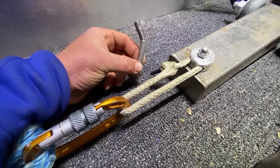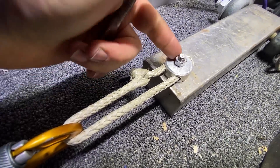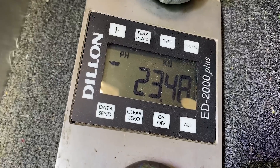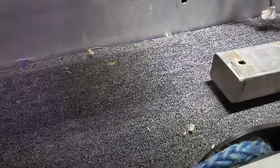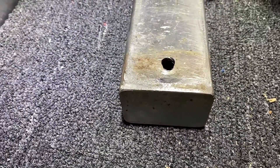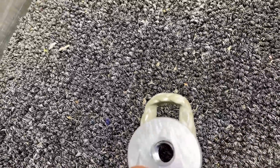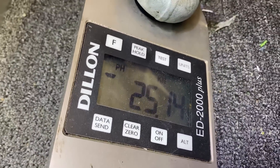So since our setup before bent the bolt so much and that was hard to get off, I used a smaller bolt — that's a 7/16ths bolt, and it's bypassing the threads and just a nut is tightened down on it, which is how I would install these. So yes, definitely better to have it flush where you're not having the bolt bending over itself — that could almost simulate this being pulled in tension versus in shear. So third test, third type of result. Our bolt there sheared off. That is why we stand behind cover. And this is still intact — you can see there that it's deforming the Dyneema Amsteel, but it does not seem to be cutting it yet. That was our strongest result so far.